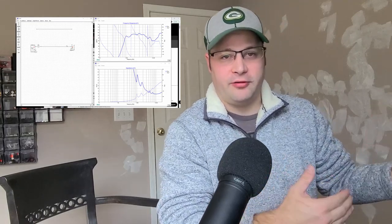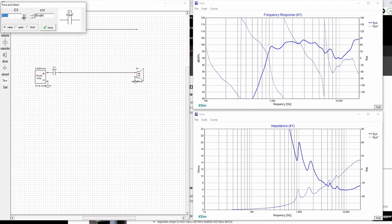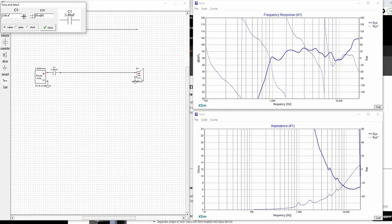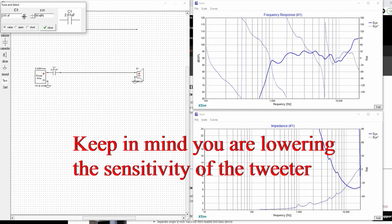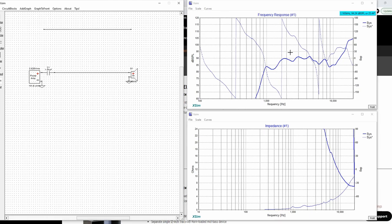The first thing you're going to want to think about is the capacitor. The lower the capacitor, the sooner you're going to start your crossover slope. We want to pull down this area to flatten out the curve quite tremendously. So we'll go with a smaller capacitor, continuing down — and we're starting to look good. Now we're back in about a 5 dB range.